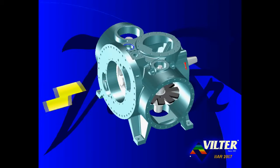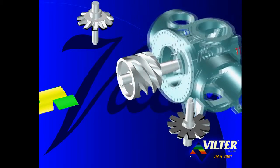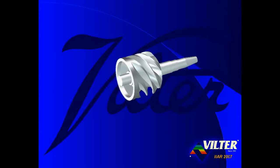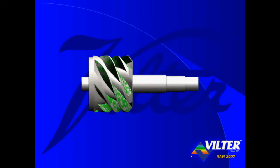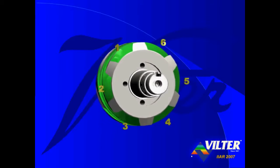Removing the pair of capacity slide valves, the pair of volume ratio slide valves, the two stargate rotors, and sliding back the casing, we reveal the heart of the compressor. The main rotor of the single screw compressor is a simple cylinder with a shaft through it.